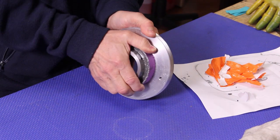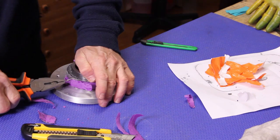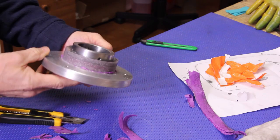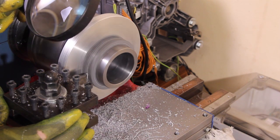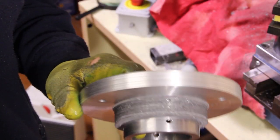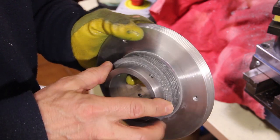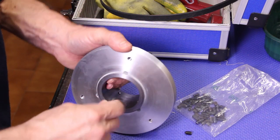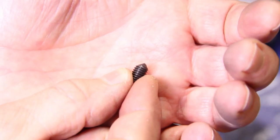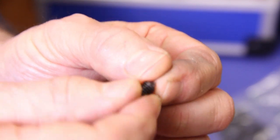It won't be easy to remove this — it's really hard. Let's attach it to the base. Almost done. So this is the finished pulley. It could be better, but it has been turned without the lead screws, manually. These set screws will help to keep the aluminum well in place — they are pointed, so they will carve their own seat inside the aluminum.